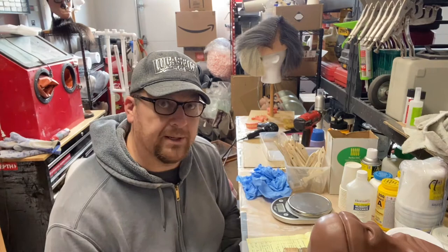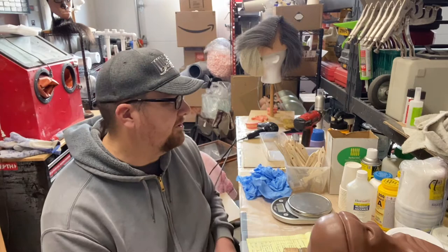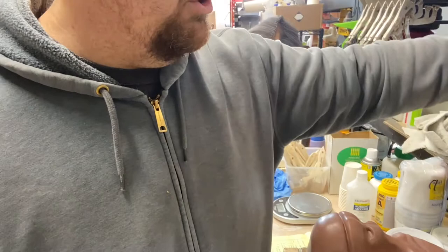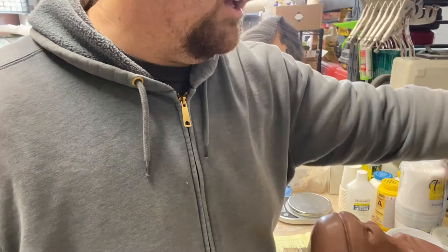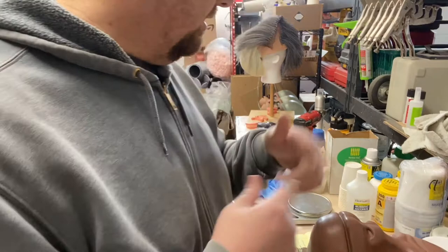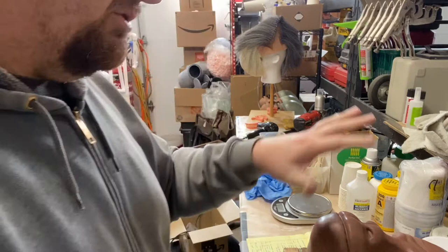I think I got that info from Reynolds Advanced Materials. I'm gonna be using Epoxamite 100. It comes with a hardener too that you mix into it, a two-part deal. That's what I use on the fiberglass. The Epoxicoat also comes with a hardener. I don't know if it's the same stuff, but it's a two-part mixture. Those are some of the base materials I'll be using to make the mother mold.